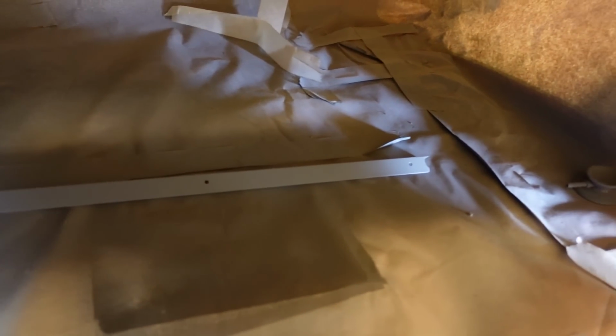So what have we been doing? Last time I spoke to you, what did we do? Oh, we primed the angled section, aluminium quadrant, as I've been told by my boss at work. That's embarrassing. But the Ali quadrant, anyway, we'd primed it. We'd used etch primer. The next stage then was to actually paint it. I've painted it a satin black using two-pack paint.